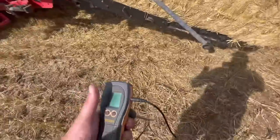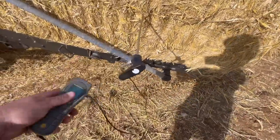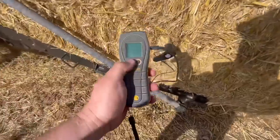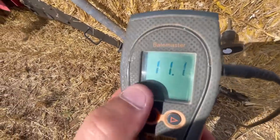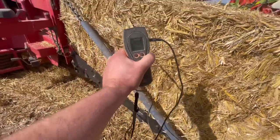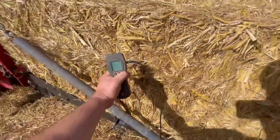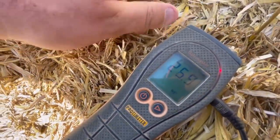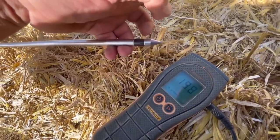Check some of these bales coming out of the back — this is probably a moisture meter. Let's get this stick — it's quite stiff, so I've got to shove it into the centre of the bale like that. Turn it on: 11.11% — dry. So that is good, that means we can go baling. We don't want it anything above 15%, so yeah we are looking good. Just to show you — if I put my hand on the end, that's what we don't want. It is quite sensitive, just from me doing that.